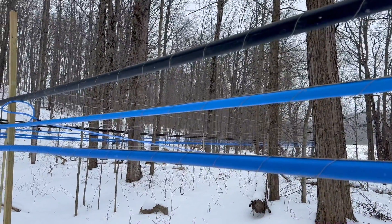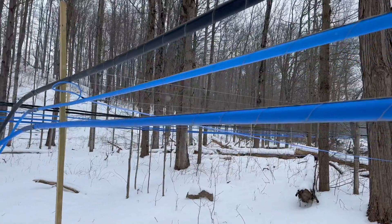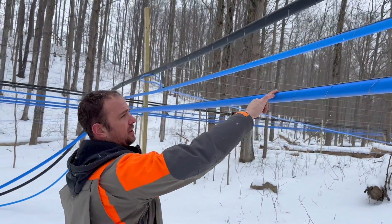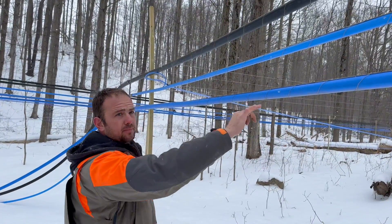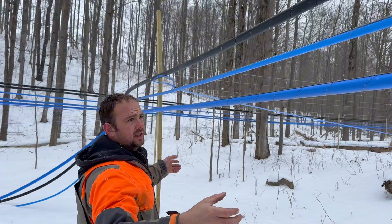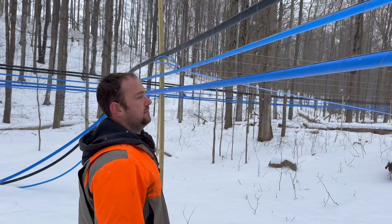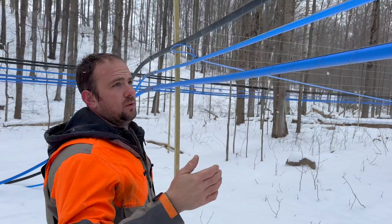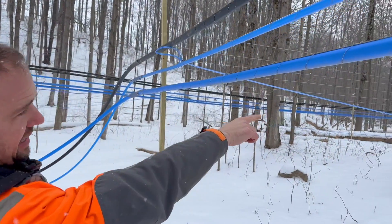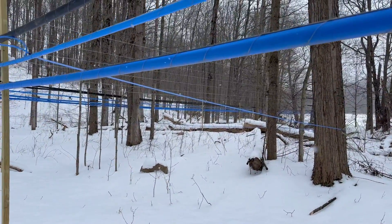It's a lot easier than using wire ties and manually tying every one foot. There's a nine gauge wire that we pull really tight with a come-along. We'll wrap this nine gauge wire around two entries, then when you use a come-along you pull it super tight, and then every 30 to 40 feet we'll put a wire tie back. We'll pull one of these tie-backs like every 30 feet and pull it side to side to make it tight.